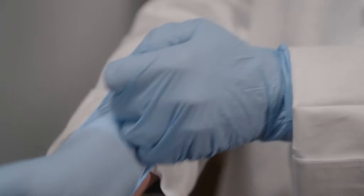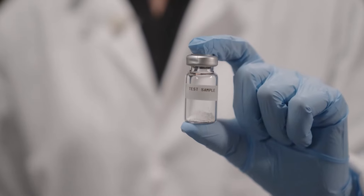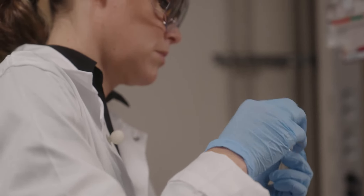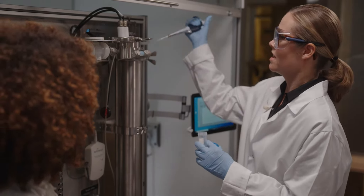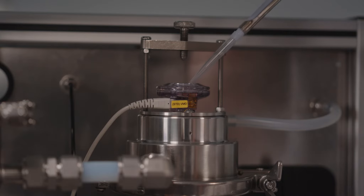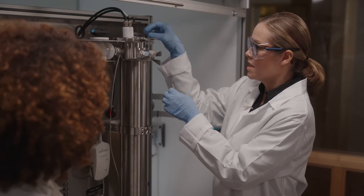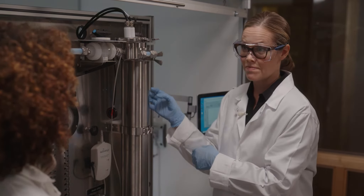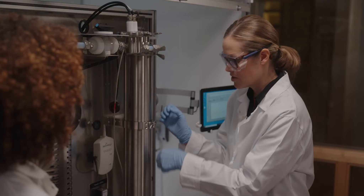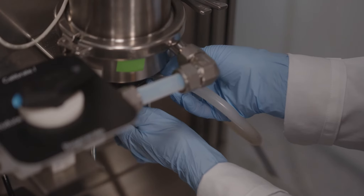Yes, of course. Gloves on, instrument on — now it's time to air dry some liquids. I have prepared this liquid solution containing the sugar molecules which we usually use when we air dry vaccines, so it's basically the same process. I will apply the liquid to the nebulizer, which you can see here. The nebulizer is placed on top of the drying column. The nebulizer will create small droplets of liquid, which will pass through an inner column within this drying column. At the same time, we have some very dry air which will circulate around the inner column. It removes the water molecules from the liquid, and in that way we end up with a very dry powder.